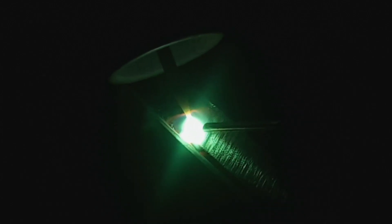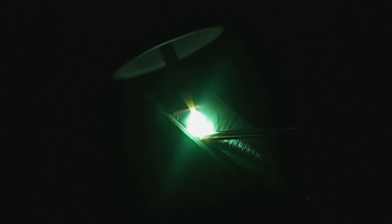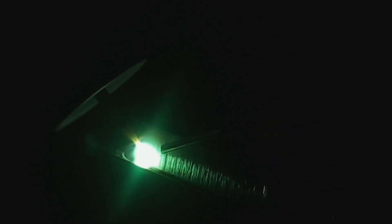Before we did that we prepped the plates using a grinder and made the plates to a knife edge. This is going to allow us to achieve penetration through our joint. We're going to be doing this by completing a keyhole dip technique — what we're looking to do is form a keyhole and then dip wire in to make sure that we're fusing both sides of the plate and getting adequate penetration on the other side of the joint.